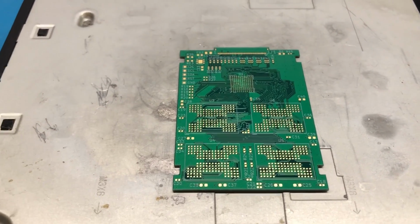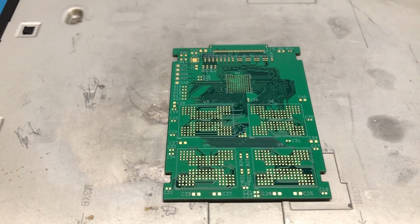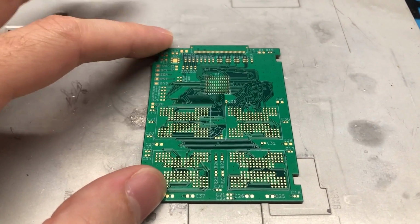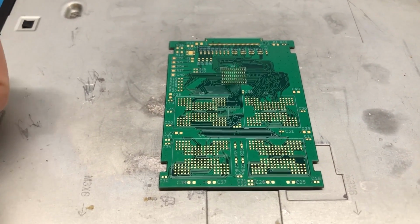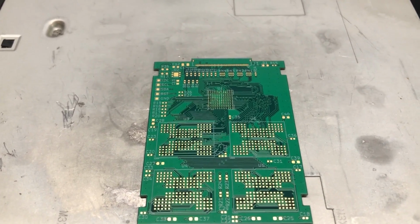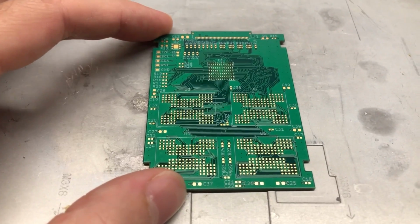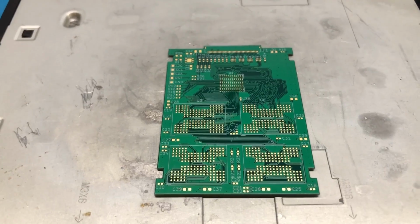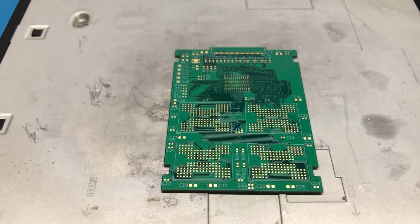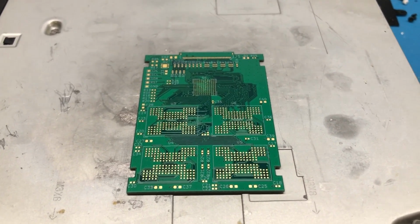They also make ones for like 2.5-inch laptop IDE and what have you, but those are also overpriced, and the quality on those is not all that great. So with that said, I've decided to design my own using the best parts I could possibly source to make it as reliable as possible, as well as be able to make it relatively cheaply. Now, of course, I won't be able to make it as cheaply as a regular SATA SSD, at least for the capacity that this will support, but it is still better than the options that are already available.